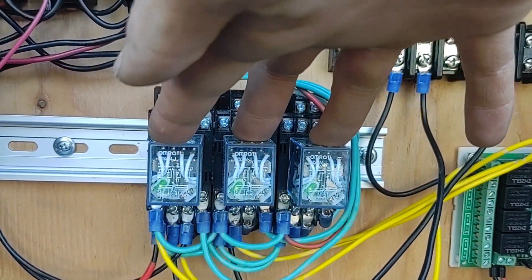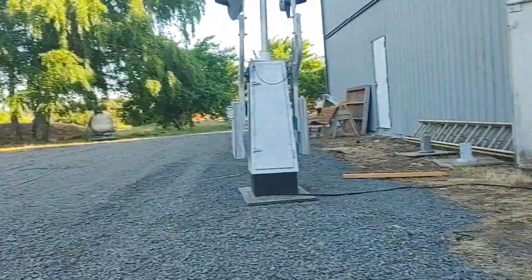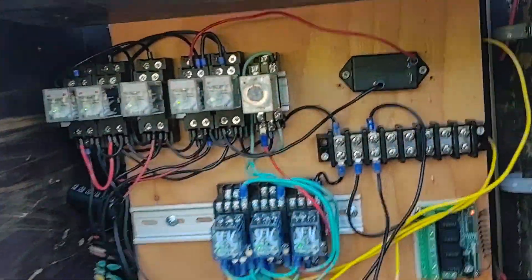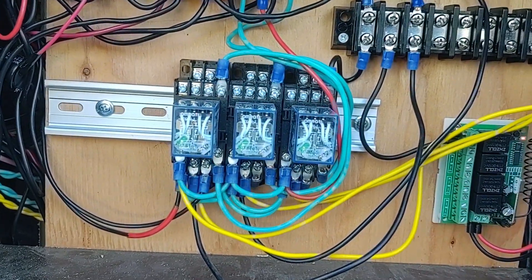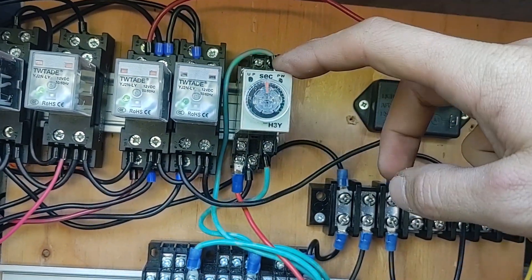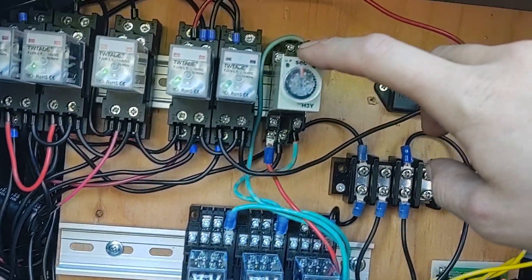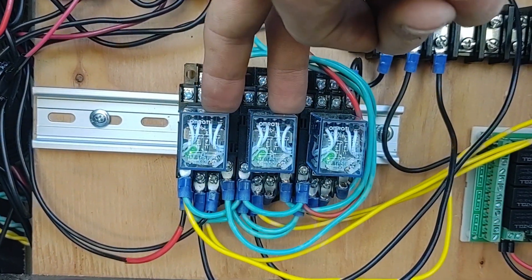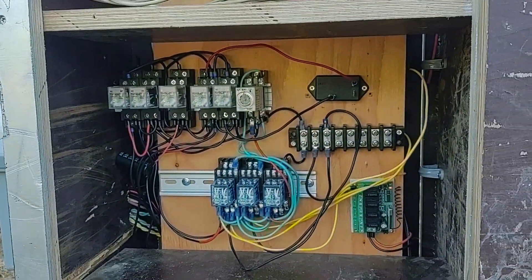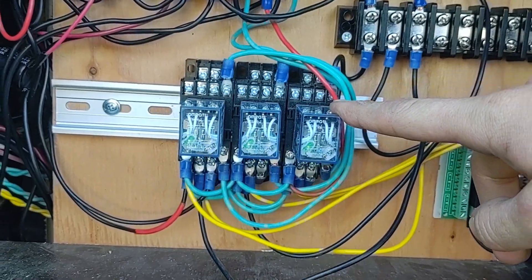Moving up, I've got these three relays right here — what I refer to as track relays. Now you might be thinking, where are the tracks? We'll get to that in a minute. These two are the approach relays and they are tied into this timer, and this is the island relay. When this timer times out, these two relays are bypassed. So if you have a train in on your approach circuit, the gate will go up, but once it gets into the island circuit it'll go down and stay down.